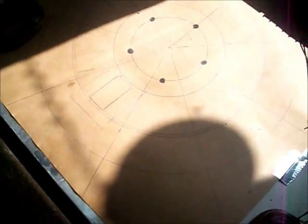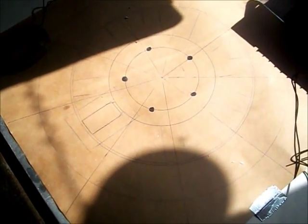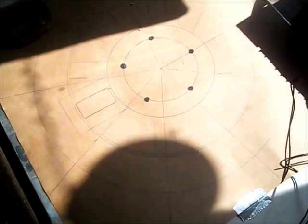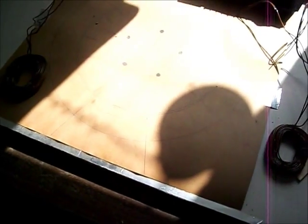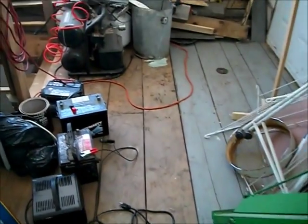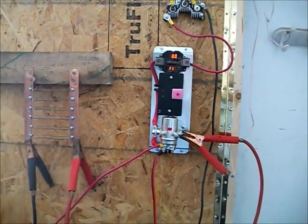If you want to see how I make stuff — I usually copy off of somebody else. This one is designed by Muddy Mudman, and he's got some videos that show exactly how to build one, so I'm not going to go through all that again. I'm using 14 gauge for the coils, 40 turn double wire. Maybe by next week I'll have it done and be able to replace what I have on the roof right now, and hopefully it's going to give power at a lower wind speed. Because right now the wind's got to be at least 15 miles an hour to get power, which is way too high.